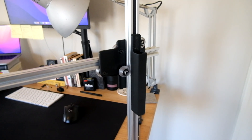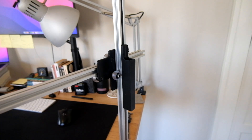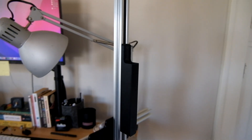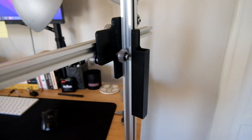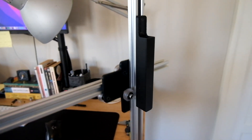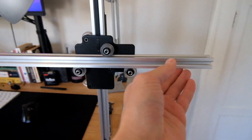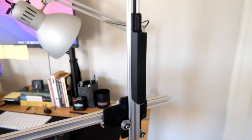Before I get started, I figure I should give you a before shot so we know what we're trying to fix. There's just this rubbing noise as the counterweight moves up and down the vertical rail, and that's what I'm going to try to eliminate. Let me turn the mic around so you can hear it. That noise is a pretty obvious problem that comes through on video. The other problem that doesn't really come through on video is that the cause of that noise — that rubbing — also causes the motion to be pretty rough. I can actually feel resistance as I move the vertical arm up and down, and that's not something you feel when you move it side to side. So these rollers provide a really smooth motion, and I would really like to replicate that on the counterweight.